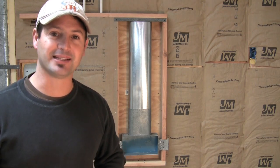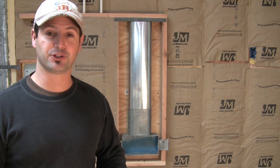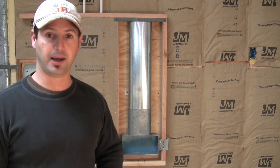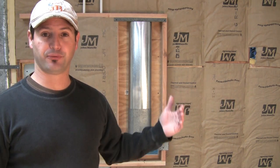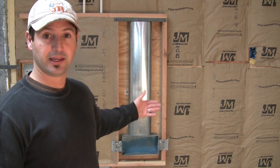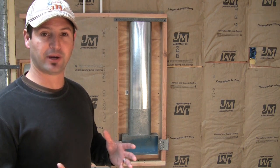Every penny you spend to heat or cool your home at some point in time travels from your furnace or your air conditioner, runs through a series of ducts until it ends up in the rooms where you want the heat or the cool air to come out. What happens as that heat comes from your furnace, it travels down through this maze of metal boxes and metal ductwork. It ends up heating that ductwork and changing the temperature of the metal that surrounds it.